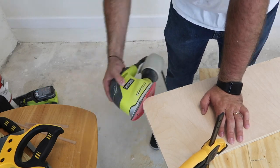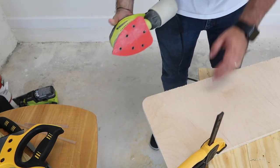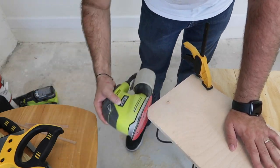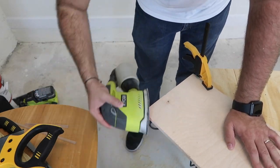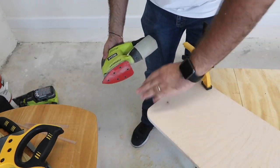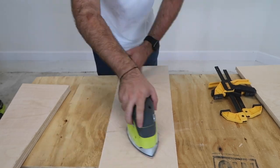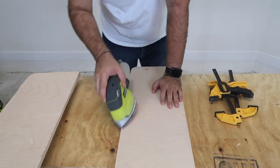Then with my small mighty sander, with patience, I just started sanding them down. I used 60 grit paper on it and it was quite effective. It left everything very nice and smooth — no more splinters on any corner, and I got them rounded off by hand. Here's where I take care of the splinters that my saw left. It was very easy — just did every side of every board and it left it very smooth. I was very pleased with it.